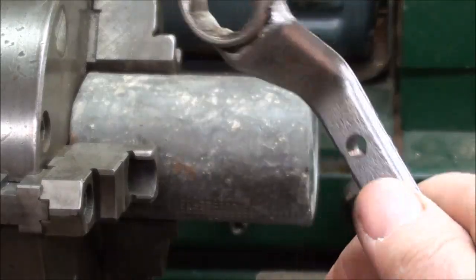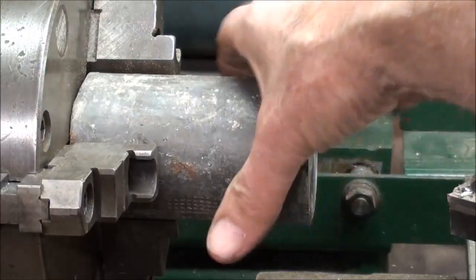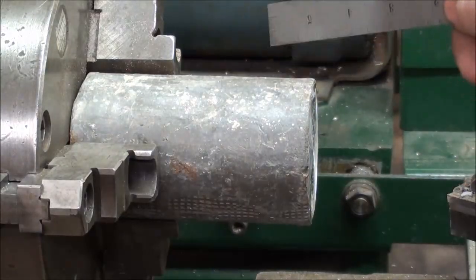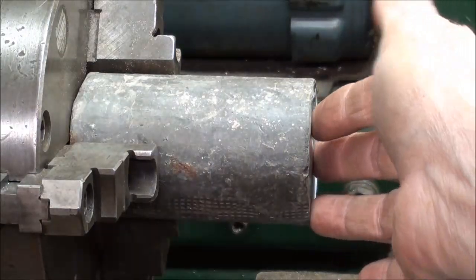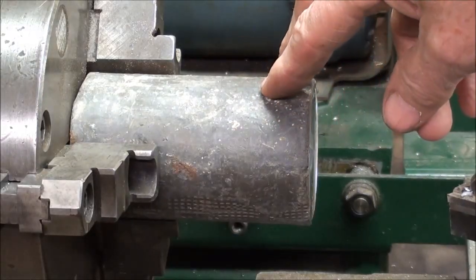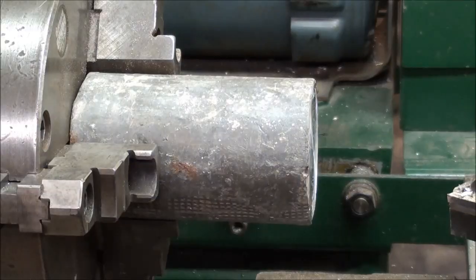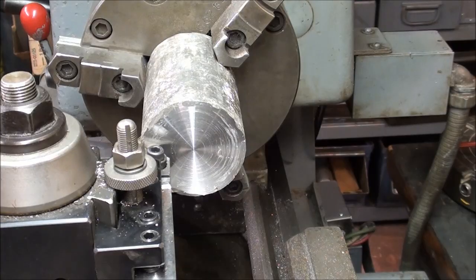I know that weakens the wrench somewhat, but for what we're doing I guess I don't care. Now for the hammer part — this is solid lead, about two and a half inches in diameter. I'm going to face it off, then turn it down to about one and three quarters diameter or one and a half, just an inch back, then cut it off so I have a hammer about three quarters of an inch thick out of solid lead, then drill a hole and counterbore it like I did on the other one. Lead requires a nice sharp tool and a medium speed — lead is very soft and gummy.